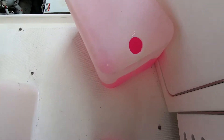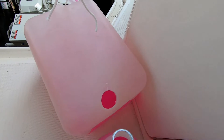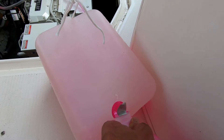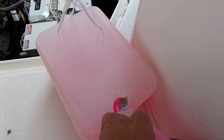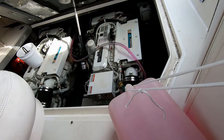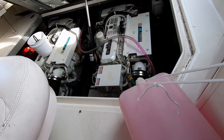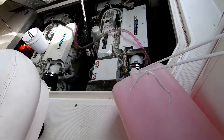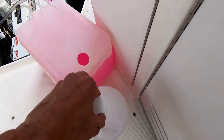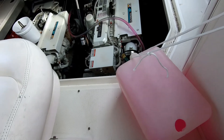I'm using this winterizing tank, which you can get online. This is a five-gallon tank, and I've had this one for a long time — customized it, replaced the hose and everything. I like having a clear hose because then you can see the pink getting transferred in. The raw water pumps on the engines are driven by a rubber impeller, so if you run them dry, you'll wreck them. You want to make sure your connections are all tight so you're not sucking air, and make sure that pink is getting transferred into the engine.